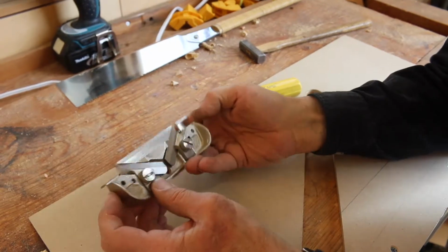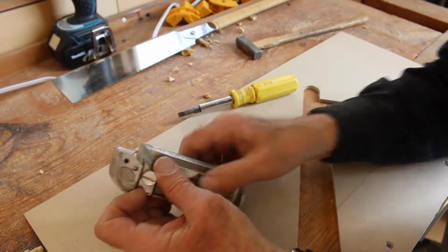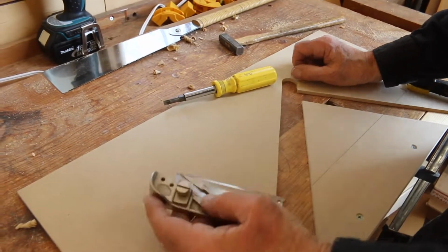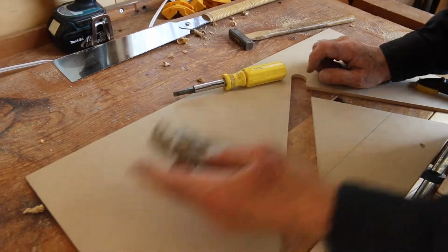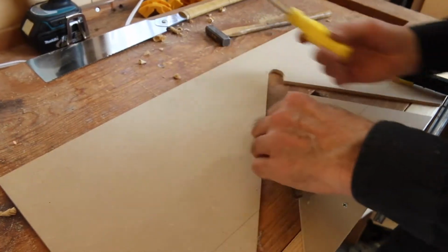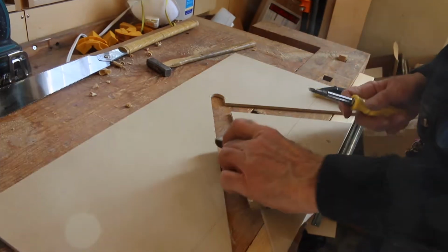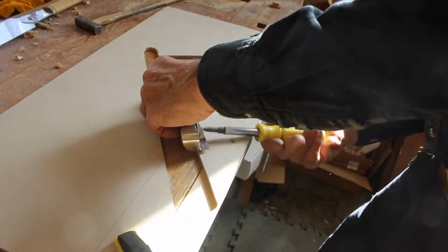I've taken the bullnose piece off so you can actually go in as a chisel plane, because I have to get into this corner and the bullnose piece will hold it off. So I'm going to use this to straighten this up a little bit and move the line over till it lines up with that circle. And in order to help me do that, this is the depth gauge fence. I'm going to reset that to get a little extra reference, otherwise it's kind of a wobble.